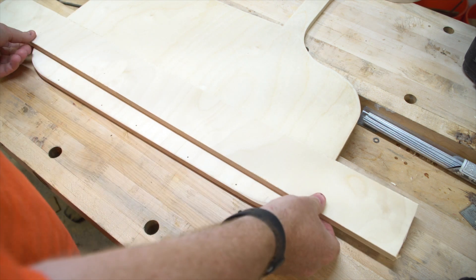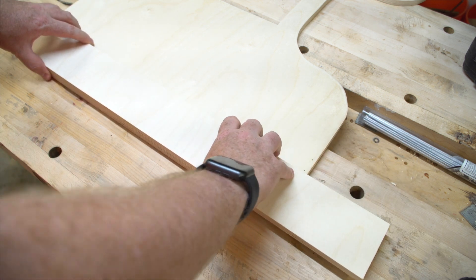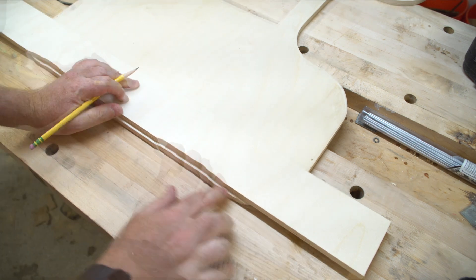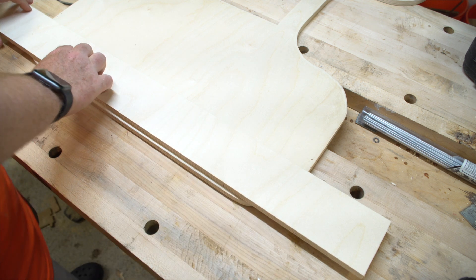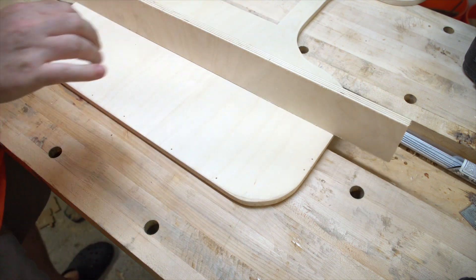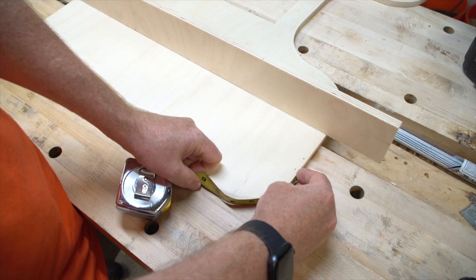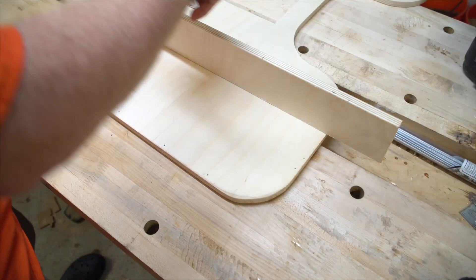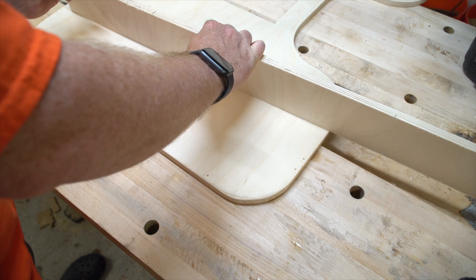Since I have more than enough I can cut the ends off afterwards. I'm going to position this and mark the center — I already have center marked on my board down here. I'll eyeball the center on this thing and mark where it starts to curve and where it stops curving. That's about four and three quarters inches — I'm going to call it five inches — and I'll mark off five inches on either side.